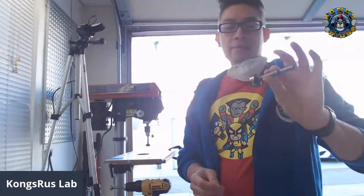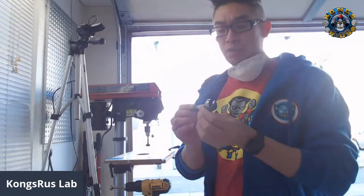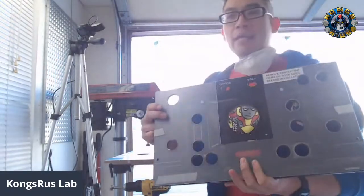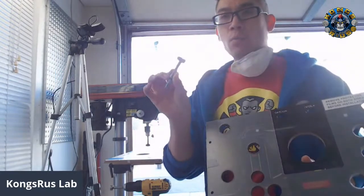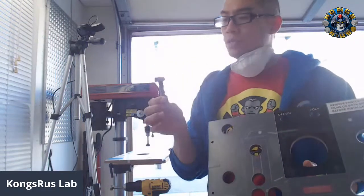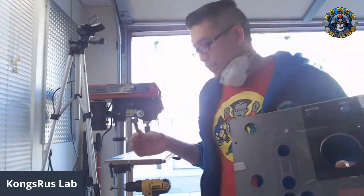Cool. So the Forstner bit is now what I'm using. This is a 1 1/8 inch hole saw as well. This is the size hole that you're gonna wanna use when you're making holes for any of your standard buttons. It's about 29 millimeters. So this hole size will fit any of your standard size buttons. That's the magic number. It's like 29 millimeters, 28 millimeters, or a 1 1/8 inch hole saw is what you're gonna use, or not hole saw, Forstner bit. I have links in the description to all the tools that I use.